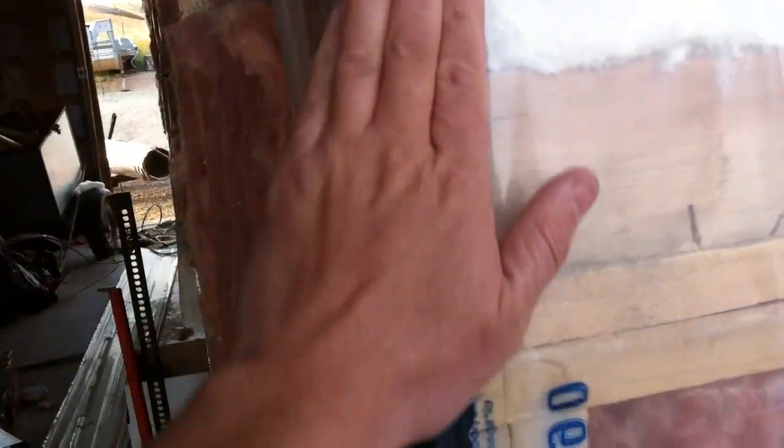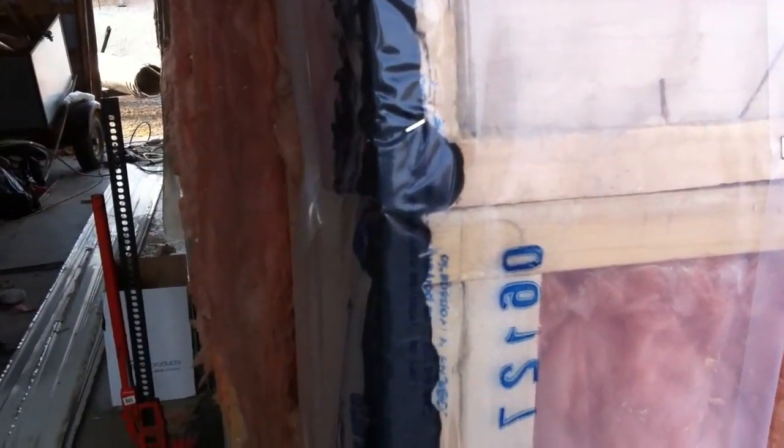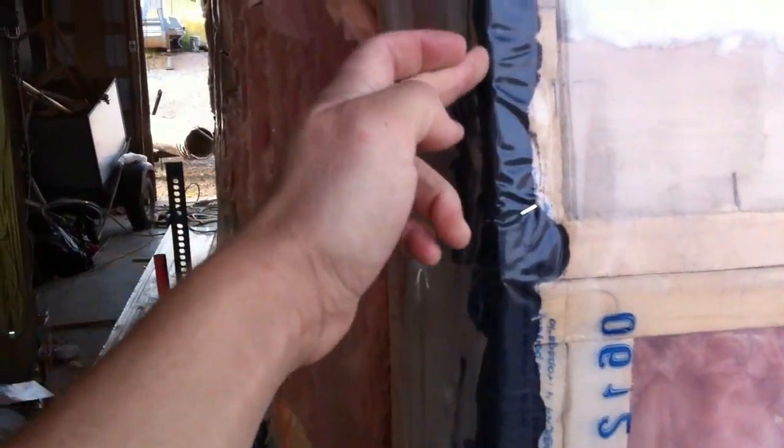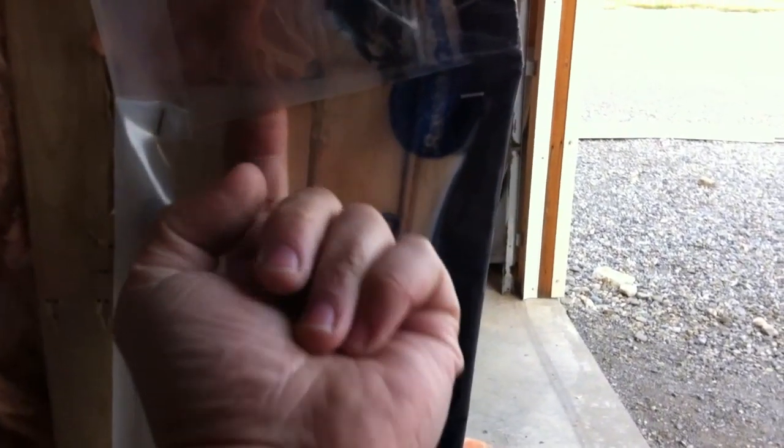So I'm just stapling it on — but first, before I staple it on, I apply a good quantity of acoustic sealer. It's a flexible sealer; it does not dry up like silicone does, it remains flexible. I apply that to the corner on both sides and then I stick the vapor barrier onto that and staple it. I make sure that when I'm going around the corner, it's lapped correctly so water will run down and flow over the top and cannot get caught behind — so this is lapped top over bottom.